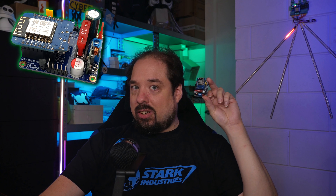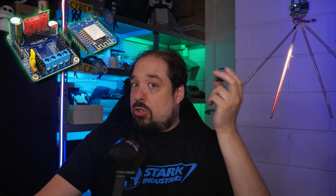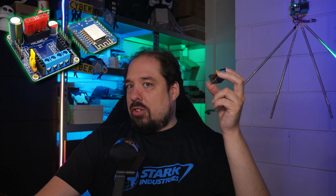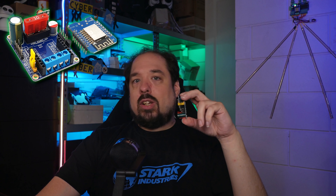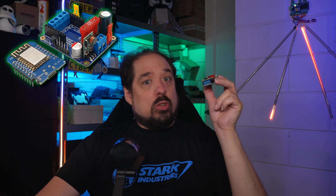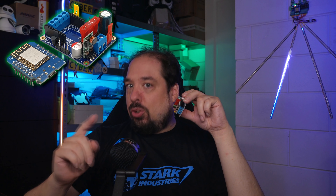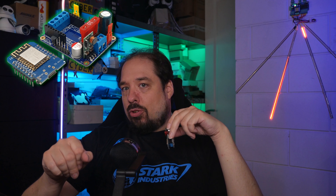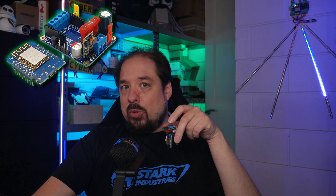First, let's rewind real quick. What does a Quinn LED Dig Uno do again? Well, it's a board that is easy to build by yourself and allows you to control digitally addressable LEDs, like you see all around me — such as 5V WS2812B or SK6812, or 12V variants such as WS2811 or WS2815. It has nice screw terminals for your wires, has reverse polarity protection, and makes sure that all the power is running through a fuse so that if at some point anywhere down the chain a short circuit or anything else happens, you are protected. It also runs all data signals through a level shifter, making longer cables to your LEDs or running a large amount of LEDs no issue.